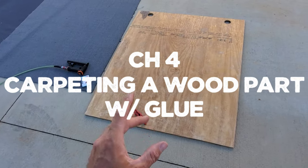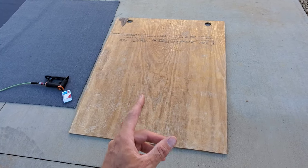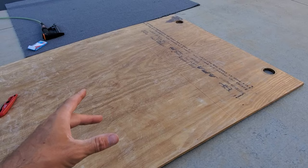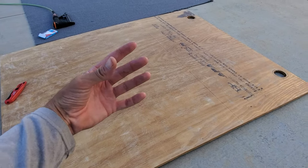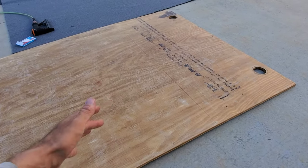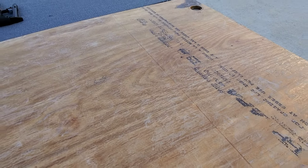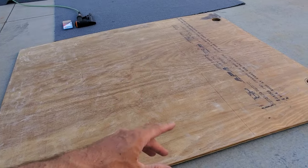Now that I've shown how to wrap the eight aluminum lids, I'm moving on to the floor. This uses a different glue and technique, even though this part is not aluminum. Most aluminum bass boats 18 foot and under come factory with wooden parts. This one is going back with a factory-style floor system and front deck — half inch plywood from Bass Tracker. What I do is take it a step further: I use half inch exterior grade plywood coated in a thick coat of fiberglass resin, gently sanded to give the carpet something to bite. That resin waterproofs, seals, and gives extra protection — it should last a lot longer.